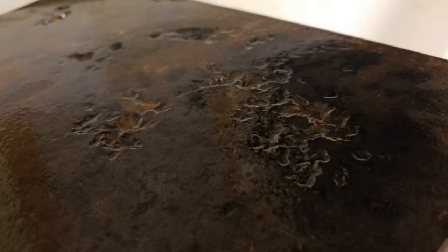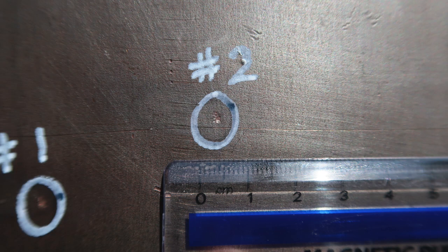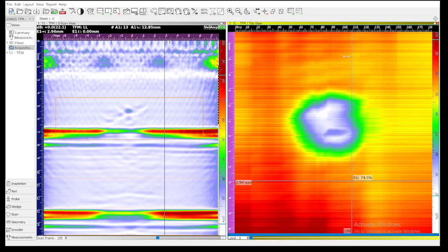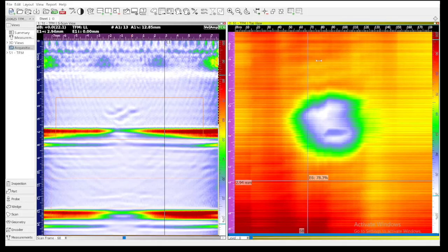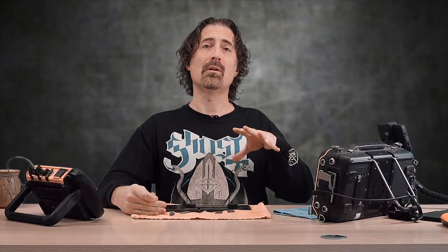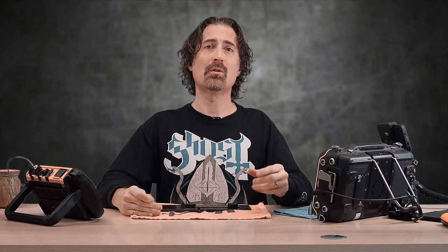Corrosion can be very abstract. Think about small pitting, sulfuric acid corrosion, or microbiologically induced corrosion — MIC. They're like little tiny tunnels, and if you're offshore looking at open drain lines with carbon steel pipe, check that six o'clock position. MIC loves that spot. If you've got noisy plate or noisy pipe and you're trying to do a corrosion scan on it, it can get really frustrating.